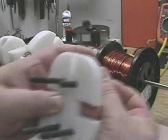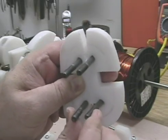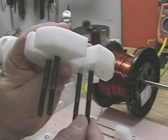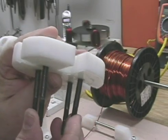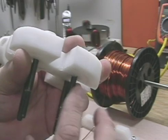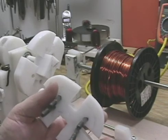So the bolts, when you loosen them up, they tend to go in like that and it pulls right off the coil. So the holes are loose — I made them specifically so they would do this. So they all fold inward to allow the coil to slip right off. And the threads are fine and they're smaller than the shaft, so it doesn't even nick the inside because of the way that's set up.